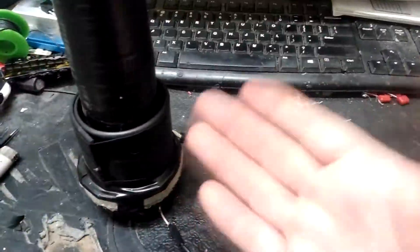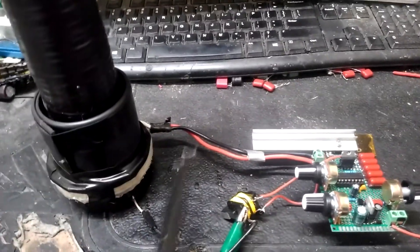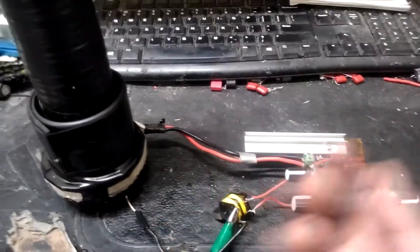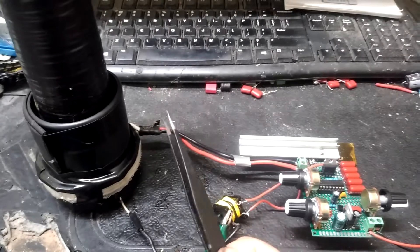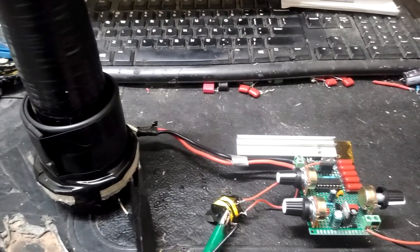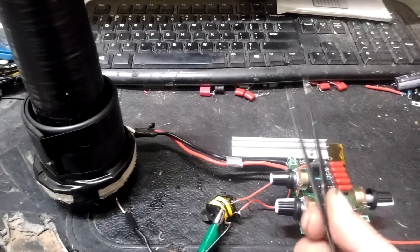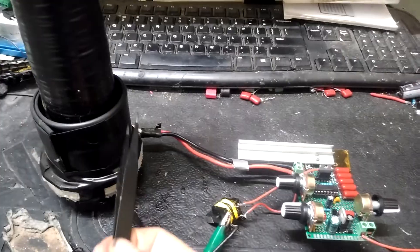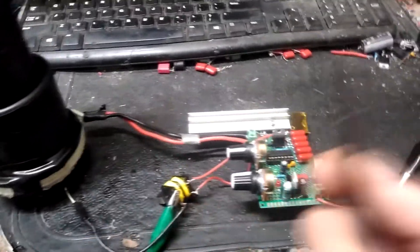One common thing with a few of these circuits seems to be simply that the higher I move the coupling, the more current I get out of the arcs. In my last setup I've got the primary sitting at just the right height where I found a good balance between voltage and current. If I drop the primary all the way down I get the highest voltage out but the least current in the arcs. If I move it up a little bit I still get a little voltage at my target level, and at the lower voltage I can still pull hot arcs.